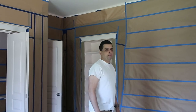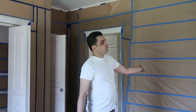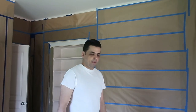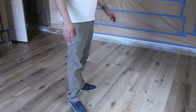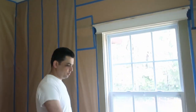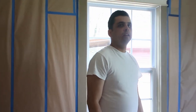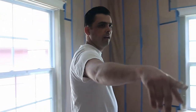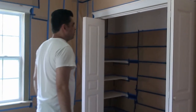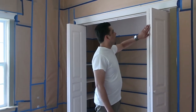All right, so we're getting ready to paint all of our trim. I've masked off the entire wall so I'm not going to paint on that. I'll also be masking the floor and the windows, leaving it exposed only to the trim that I want to paint. I'm using a little spray gun that should give it a really nice finish without any brush marks. I'm also leaving the doors and the shelves exposed so we can paint them the same color as our trim, which will be a bright white.